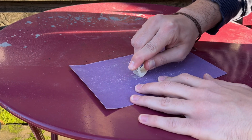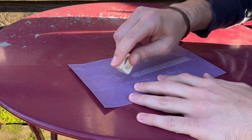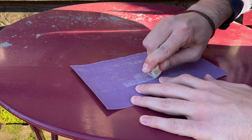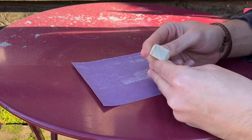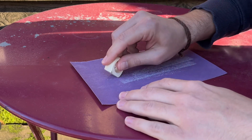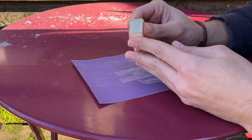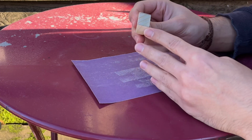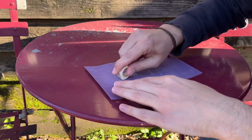I commence the sanding, taking great care to control my movements, checking after each pass, making sure I'm grinding parallel to the guideline I drew. If the initial couple of passes are not parallel, I make small adjustments and favor the other side until I reach an even grind. Then I just lock that angle in and continue to the line.